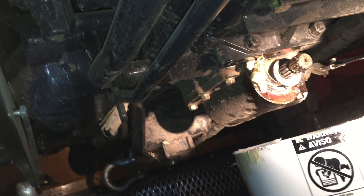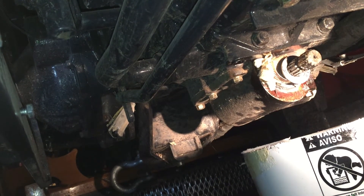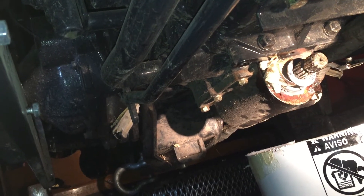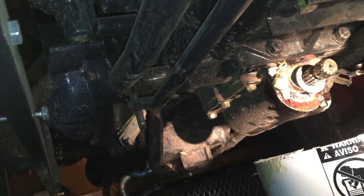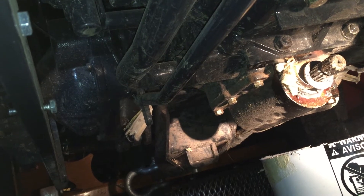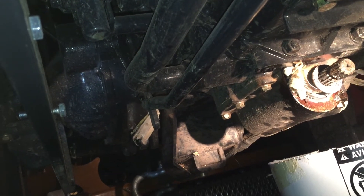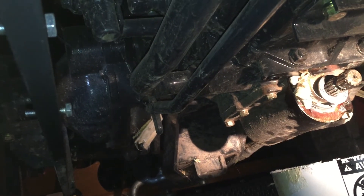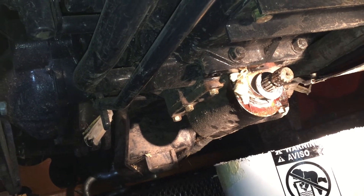Maybe it'll work with oil. You can see the idea: the two washers are there just so I can push hard against that hose clamp, which pushes hard against the plumber's putty. I've wrapped it in a bit of towel just to keep it all in place, and it looks like I've gone to a slow drip — that might just have to be the way it is.